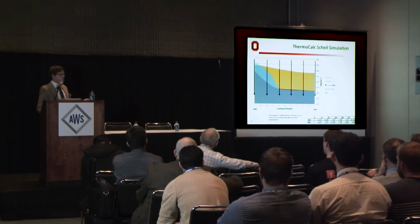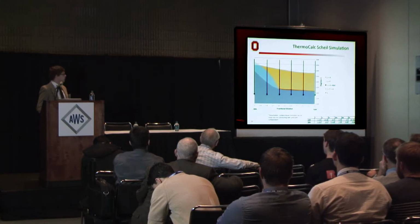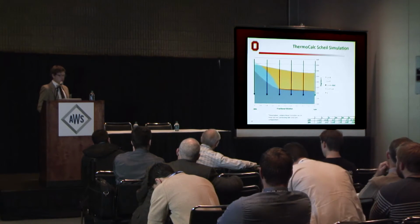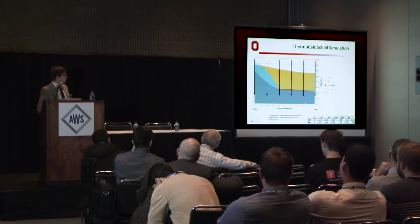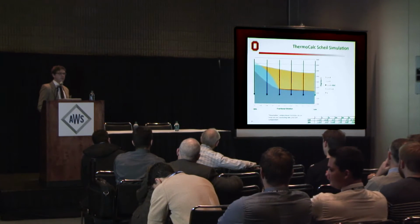This is, by the way, a Scheil Thermo-Calc simulation of the 304L and 52M system. And at dilutions from 0 to about 60%, Thermo-Calc picked out a second FCC phase, which ended up being, knowing from previous experience, the niobium carbide matrix eutectic.